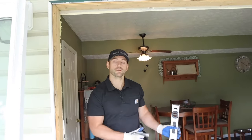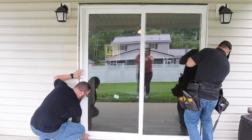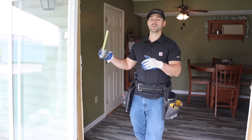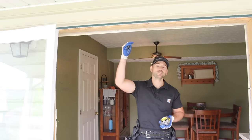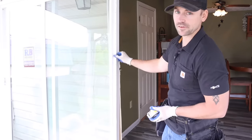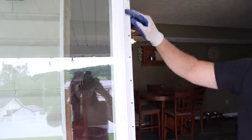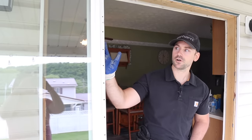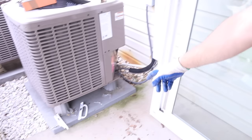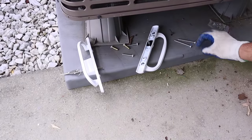So what we're going to do is dry fit the door into place first before we put the liquid nails in and make sure it all works out really well. When it comes to setting patio doors, you definitely need a second set of hands. After we set the door into place, we realized that we need to build this opening down a little bit. Also take note — this is a nailing flange and this is for a new construction house. So typically you would want to get a door for an old construction house that wouldn't have this. We've got to make sure the nailing flange hits the side of the house so we can anchor the door, and the door latch down here is going to have screws through it to hold that side of the door into place as well.